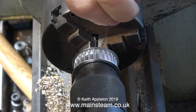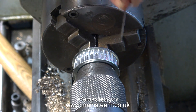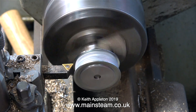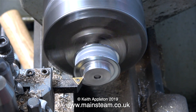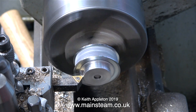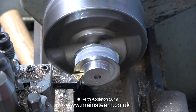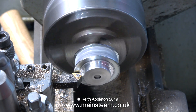And talking of tooth belts, here are the pulleys on a mandrel in my lathe. Because the mandrel is only a quarter of an inch in diameter I'm only going to be able to take very light cuts, but there's no rush. I machined the flanges first and then turned the centre very slightly. It wasn't really that much out of true and I'm only doing it for appearances' sake because I didn't like to see the pulleys looking a bit eccentric when the engine was working.